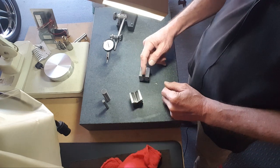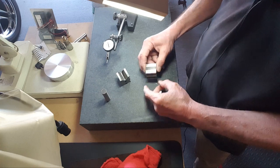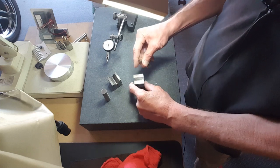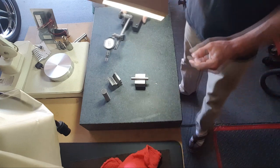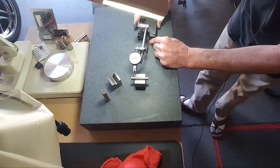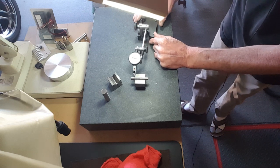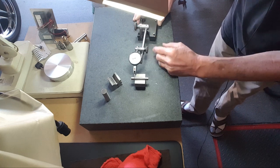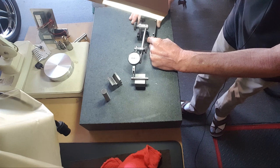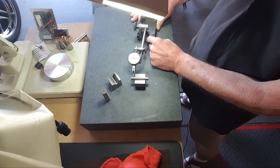What I care about is this groove. They're all clean and wiped down. When I'm putting it in a vise, I care about this groove with respect to this back surface. So I've got a gauge pin sticking in there. If I come over to an end - this is a tenth indicator. I'm pushing all over this block and it's not moving, it's solid, but I'm getting different readings.